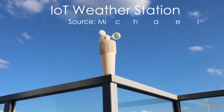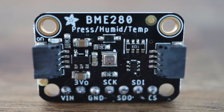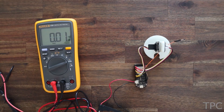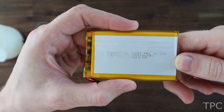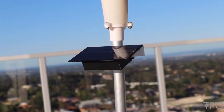The weather station uses a BME280 sensor to measure the temperature, pressure, and humidity of the ambient, while the anemometer uses a Hall effect sensor. Before the assembly, let's check the power consumption — with a very low power consumption, the weather station can run up to 124 days. Apart from a 3000 mAh battery, the weather station is also solar powered to increase the overall run time.